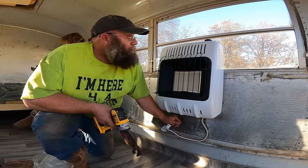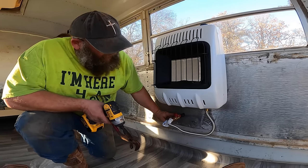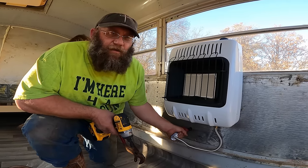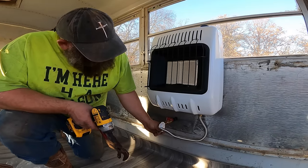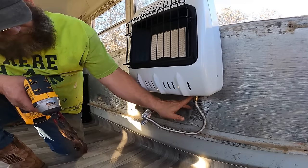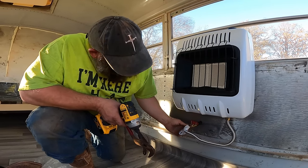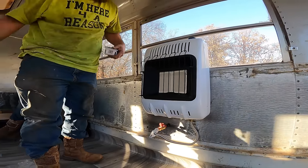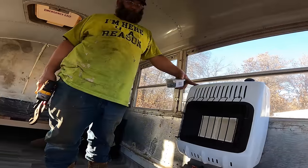And it's that simple. Which ends do you have to use the Teflon tape on? So you use the Teflon tape on any threaded end other than the flared ends, because the flared ends are built to seal themselves. Okay. So you only needed it to hook it up to the black pipe, right? The black pipe and into the bottom of the heater. Okay. But the hose didn't need any. No. Okay. All right. Just for anybody who didn't know how to install one of these things, it's fairly simple. Especially for somebody who knows how to do it.